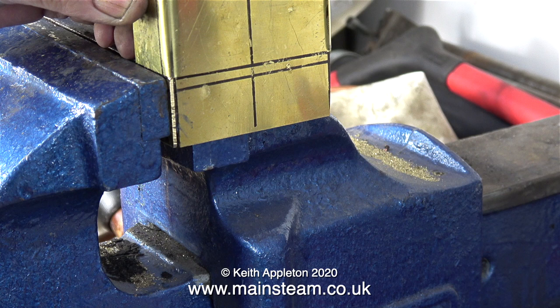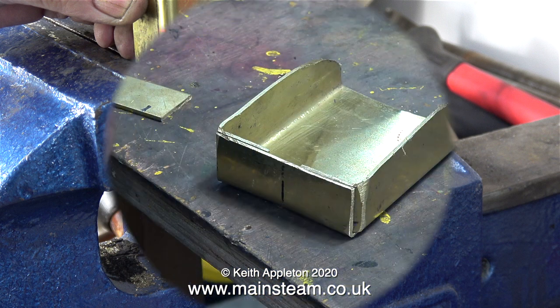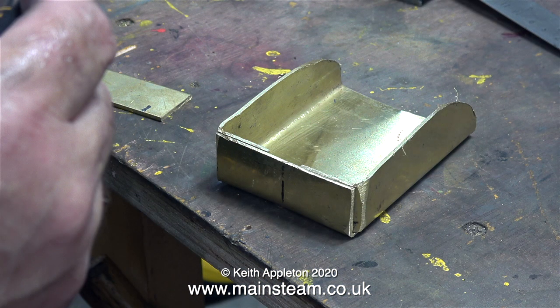The next part of the job is to bend the two side pieces inward, and once I'd done that at both sides I bent the remaining flap upwards to meet them. Once I'd bent the two tabs inwards followed by the main flap of metal, I tidied it up using the bandsaw and rounded and chamfered the front part. It's a bit rough at the moment but it will look marginally better once I've silver soldered it, after which I will clean it up properly and shape the shovel.